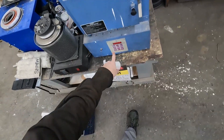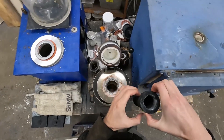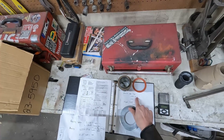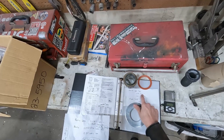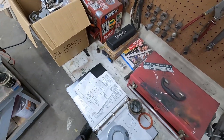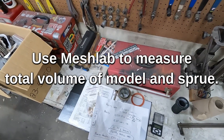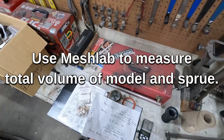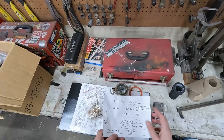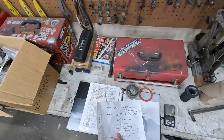The burnout oven has been going all night long, holding at 1291°F. We have a crucible which we're going to fill with pieces of bronze up to the casting temperature of 1055°C. This is yellow bronze from Stuller Jewelry Supply Company. I used MeshLab to measure the model volume using the geometric measures filter, then based on the bronze density of 8.7 g/cm³, calculated how many grams of bronze we need. We're going to use 152 grams of bronze.